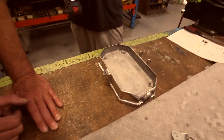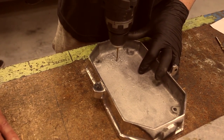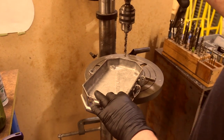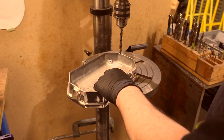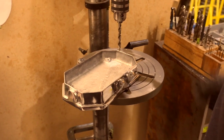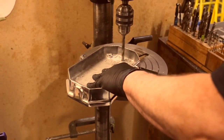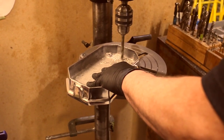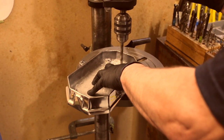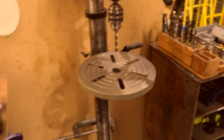So we've got two little pilot holes there. This is where we use the drill press just to put the hole into the base of the bulkhead so that the wiring can go from the lamp holder into the mains behind the wall. There we go. Now we move on to the lamp holder.